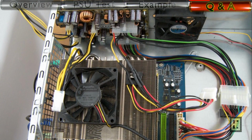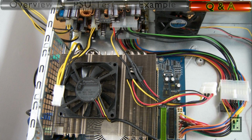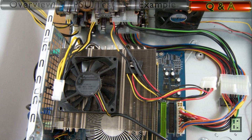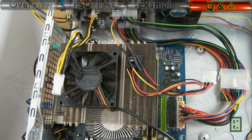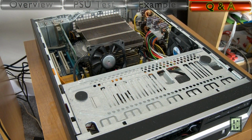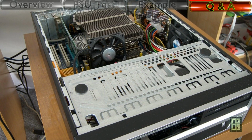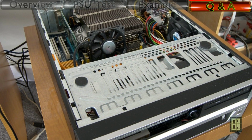The biggest in power consumption is the GPU, especially if it's a dedicated GPU. So a dedicated GPU can use 2 times as much as this power supply can deliver, so it will not work in most cases with a dedicated GPU, except with very low power GPUs like those under 20 watt or something like that.